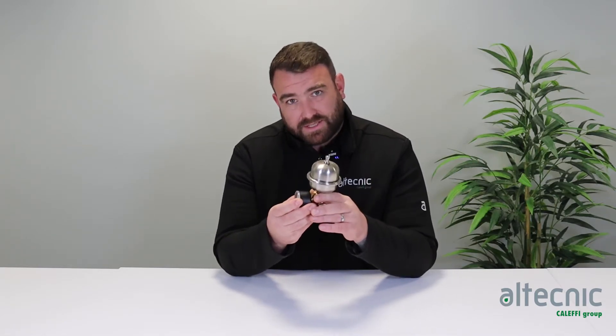But what we've also added to that is a shock arrester. The way new systems are built now and the way properties are built, we seem to get quite a lot of reports of issues with water hammer. That can come from noises like a loud banging noise, or you get a vibration noise or reverberation noises through the system. So to eliminate that we install what we call a shock arrester.